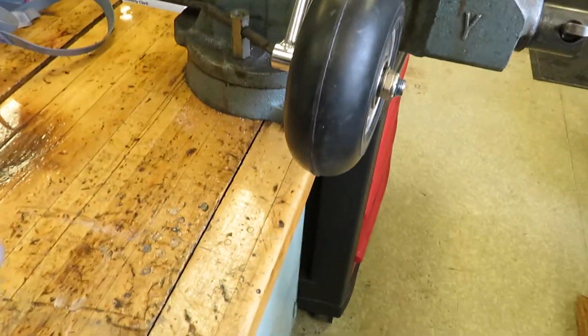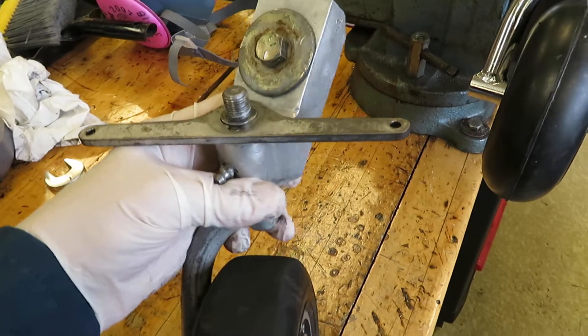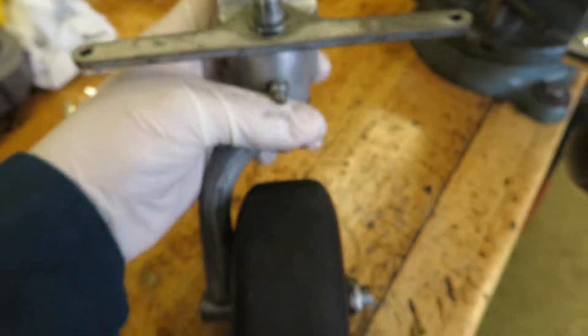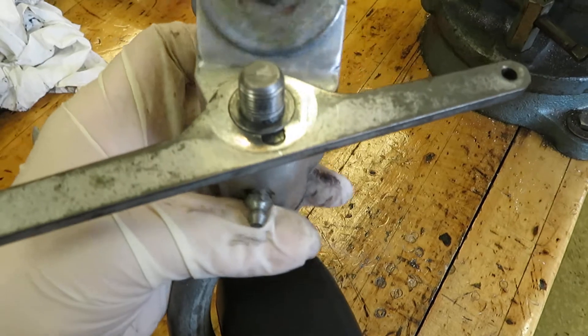I think a lot of RV guys and other people are using these with great success. I don't know why I had an issue with it, but I made a modification to my tail wheel early on to make it steerable only and not full swivel, and I'll show you why. I almost lost the airplane years ago landing because the tail wheel came out of steerable into full swivel. Normally you push on the rudder pedals and she'll go left and right — that's great — except it'll go into full swivel mode if you pull too hard or jerk it, or if you get to the limits.